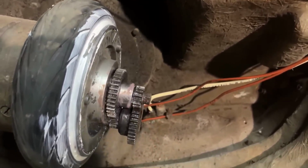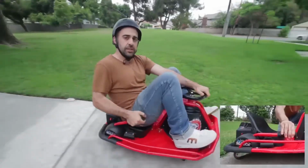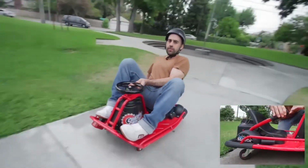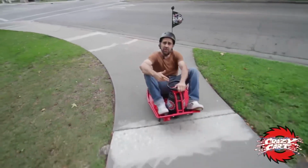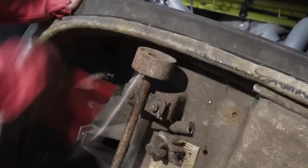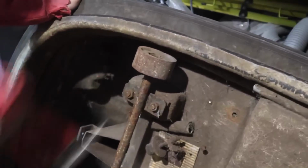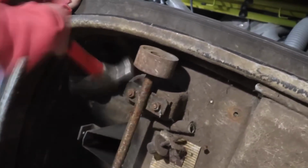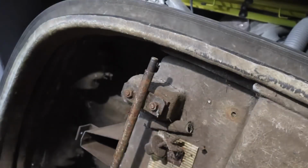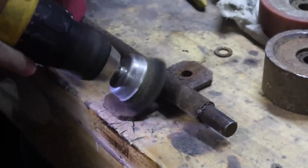Now comes what I think was the best part. I wanted to turn this little car into a drift cart, or a drifting car. So I started researching how they worked. It has a very interesting system. They have some swivel wheels at the back set at an angle, and this same angle makes it so they can't turn and stay straight. But they have a lever that changes that tilt and now allows them to turn freely, thus allowing drifting.